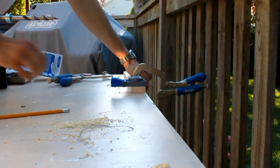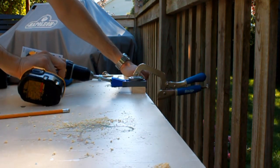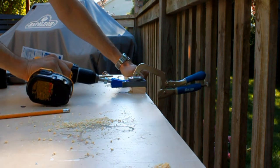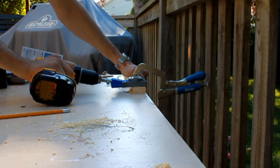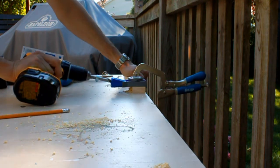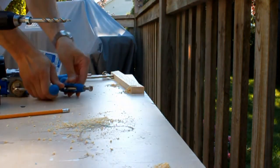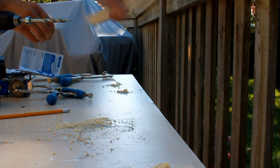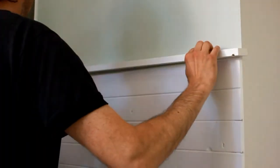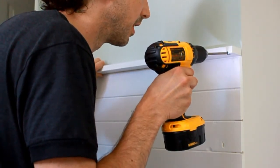Now here's a little tool that I love. I'm not one for endorsements, but what the hell. I decided to drill pocket holes into my chair rail lined up with the wall studs for easy installation. I'm using the Kreg Jig Jr. Just look how easy that was — un-freaking-believable. Place the pre-painted, pre-cut, pre-pocket-hole chair rail above the paneling, then drill into place.